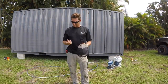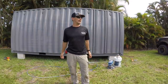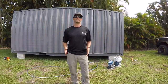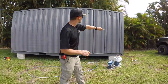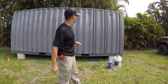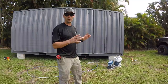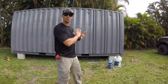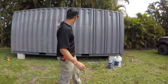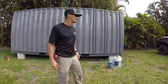Florida is toasty. Now that we got all the painting done, we're going to go ahead — I bought those 12-foot long Trex boards, I keep calling them Trex but they're PVC or composite deck boards. I'm going to cut them exactly in half and put those in just this one section, which is why I only put the backer — the substructure — in that certain area. I couldn't put that one directly in the middle because it would have been on the ridge, and I want these to be as close to the end as possible. The Trex boards have little hidden fasteners so we're going to hide those — hopefully we won't even see any screws when we're done. Then we're going to put some aluminum channel on the ends to cover the cuts. We'll have the painted metal and then a whole section of horizontal wood that gives it some architectural dimension.